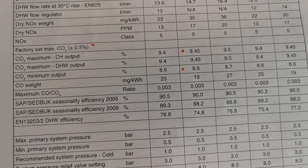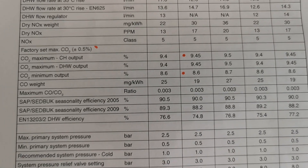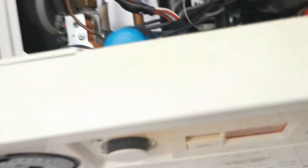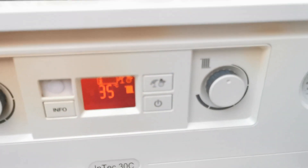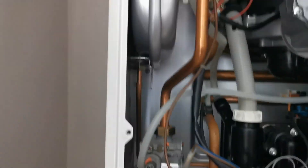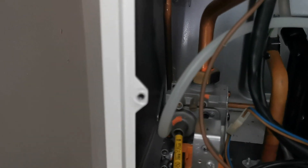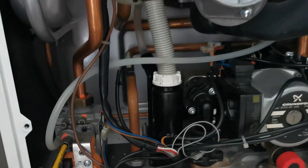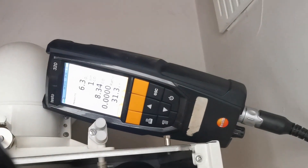I've done a little red dot on the manual so I know what I'm looking for — adjust as necessary. To put it into service mode, hold down the reset and then turn the right hand dial all the way anti-clockwise — that would be minimum. You've then got a large 4mm hex key behind the brass cap and you can adjust it there.